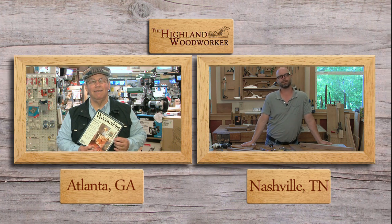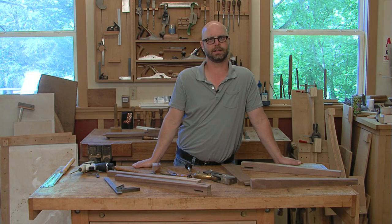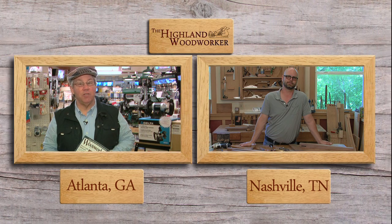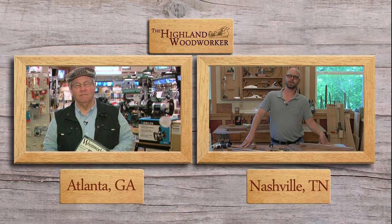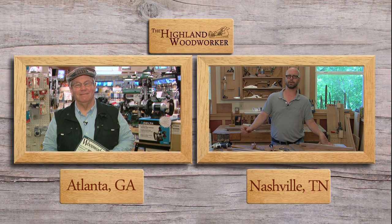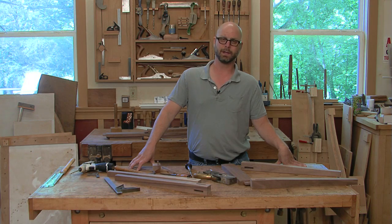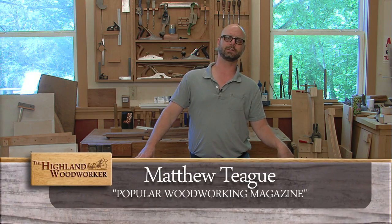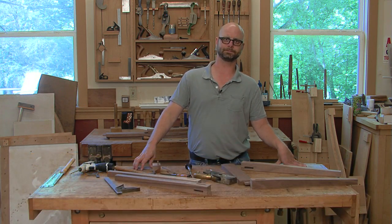Well, today we're going to talk about pegged mortise and tenon joinery. This is a very traditional technique. It's been used for ages as a way to reinforce these joints. Matthew, is that for strength or decoration? It's a good question, and it's actually both. Any mortise and tenon joint that you reinforce by driving a peg through both the mortise and the tenon piece is going to definitely add strength to it. But if you're paying attention to what you're doing, it's also a really easy way to have a nice decorative touch to whatever you're making.